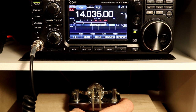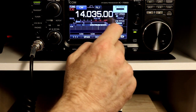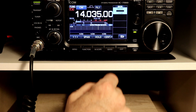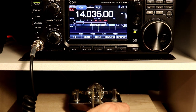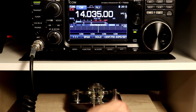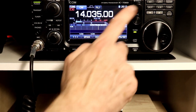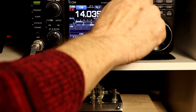So it's not quite a second — a little more than half a second or so. You can change it down to two dits, which is the minimum, so that's almost like full break-in — even the briefest pause between characters will put you back into receive. Let's put that back up to the default for now.